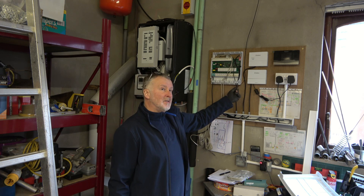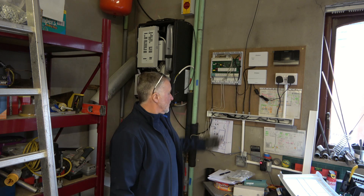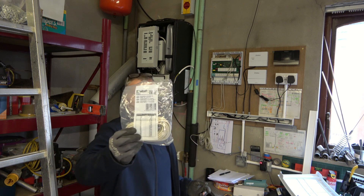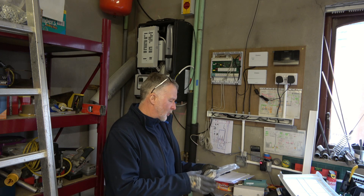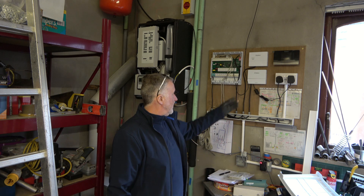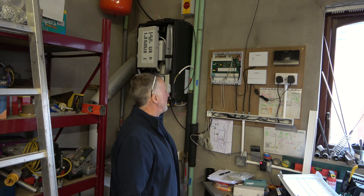This wire has a resistance of about 4.7 ohms, so it represents about a tenth or a twentieth of a degree when you connect it to an AR10. The sensor has a resistance of about 800 ohms at 55 Celsius, so the resistance of this cable would represent a small error in that. It's no big deal.